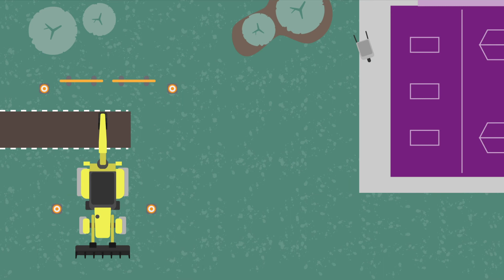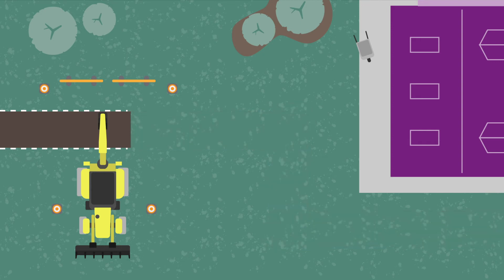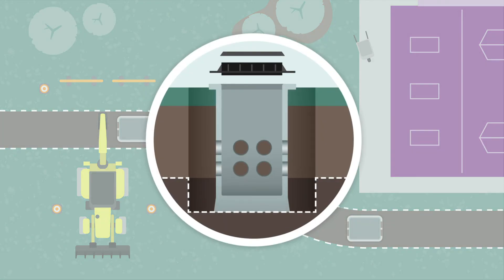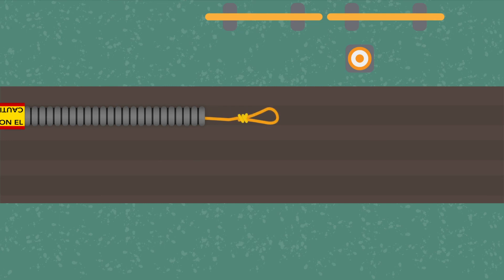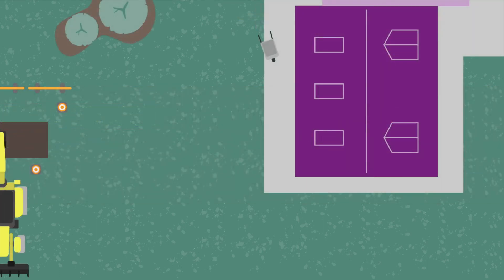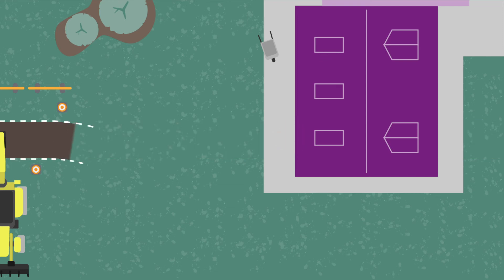This trench should be as straight as possible, avoiding sharp bends. If the route of the cable is to go around a 90 degree bend — say, the corner of a property — this bend must have a slow radius, and if over 30 meters you will need to leave cable draw pits open. You must remember to install a draw cord through the ducting if it is over 5 meters, to help us install the cable. No excavation for the cable route should run under any building structure; the route should always be on the exterior of any footings.